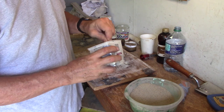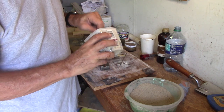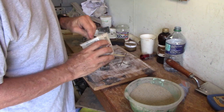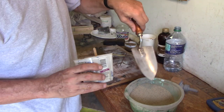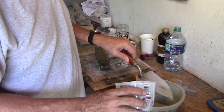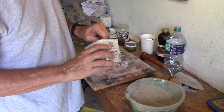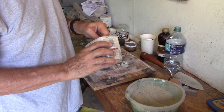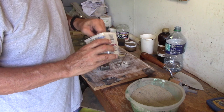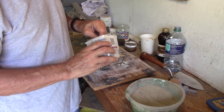Flour and molasses acts as a binder — a binder that binds the sand together to hold while you're molding. And then of course you want it to unbind, you want it to break apart after you put in the 1200-degree aluminum. Aluminum pours best right at about 1200 degrees. Cooler than that it might not be liquid enough to pour through all your little sprues and thin casting parts.